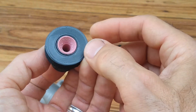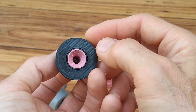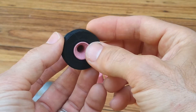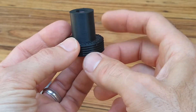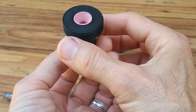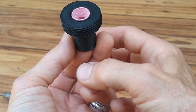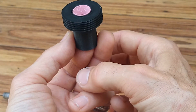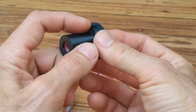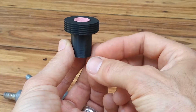I would recommend, if you're going to test these Harbor Freight nozzles in this 3D printed sleeve, I'll include the STL files for all of these in the description. If you have a 3D printer at home, feel free to download and print them up. If you're going to print this particular part, stand it up and print it like this. Make sure you have supports down to the bed and just a skirt — you don't need a brim or raft. Just a skirt to clean out the nozzle is all I used and it worked out great.